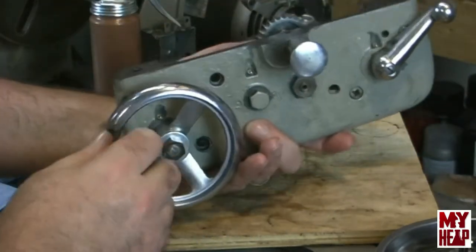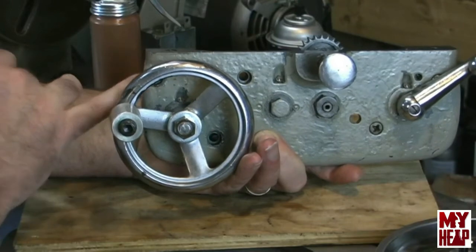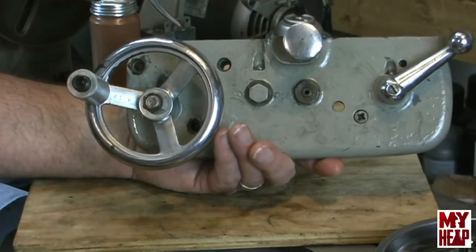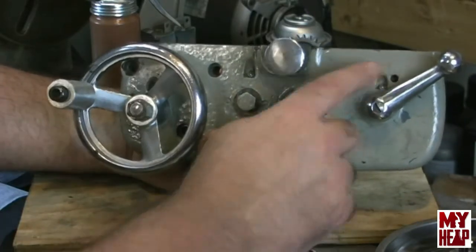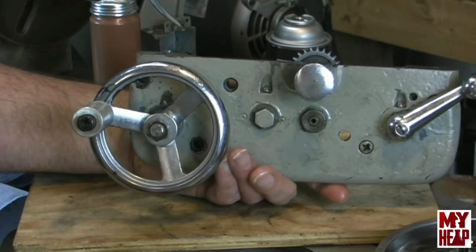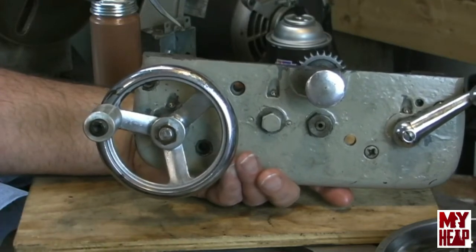Now, on the back side, recall that I had three different fasteners in here. I think I had a socket head cap screw over here, a regular hex head bolt over here, and then down on this side I think it was a piece of quarter-20 all thread with a square nut on both sides. So what should be in here are Phillister head screws. I would assume they would be Phillips, since that's what these are, but what I bought were socket head cap screws. I have called Fastenal to get some inch-and-a-quarter long, quarter-20 thread per inch Phillister head screws. They'll be flat, but at least that's closer to what was in here than what I'm going to put in here.